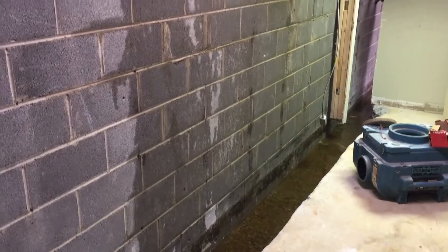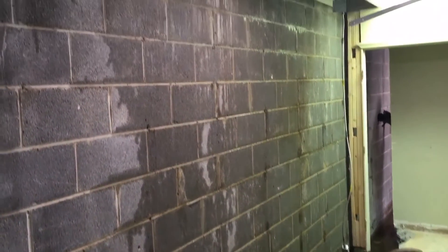We've got a basement floor and our stem walls and our footer — we've kind of caught it in that pocket and it's expanded and pushing up. We've got natural exposed areas where water will seep through our basement at the cove joint or on top of the footer. It's pushing. The water has nowhere to go. The soil that supposedly won't perk is somehow perking water up through it.